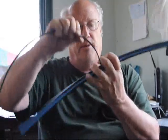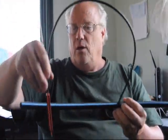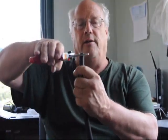Like that. And then I always like to check it because sometimes you can put it in and it isn't in correctly. But it should be a nice tight fit. Okay? Now, when you want to connect your blue stripe pipe to a garden hose, what I like to do is I like to trim off the pipe so it has a nice flush perpendicular cut.